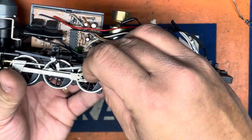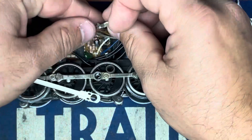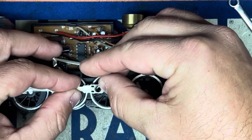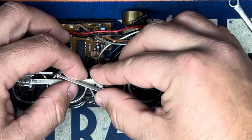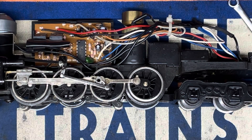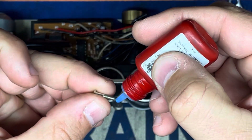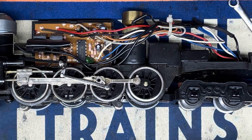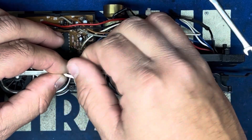Put this on top. Now let's not forget our sleeve — okay, sleeve's in place. Spacer. Put the other side rod there. Insert it, rotate that around, make sure it's pointed the right direction. I always like to put a little bit of Loctite at the end of the screw that goes into the driver — this will keep that from backing out. Okay, we'll just get that hand-started.